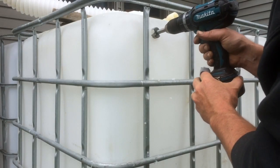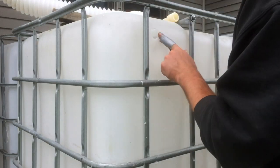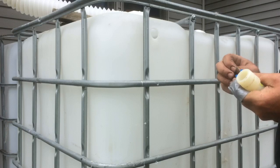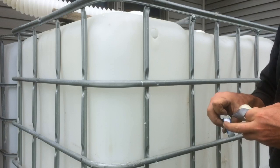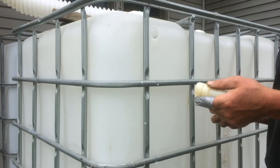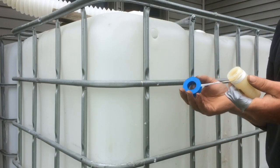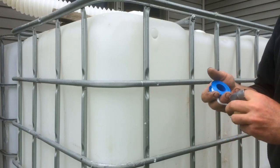I very carefully and slowly drilled into the plastic in a smooth and even way so that I had a very clean hole — just a tiny bit smaller than the threading. It's a great way to deal with any potential drips or leaks, especially for an overflow where a little bit of leaking is not the end of the world. So I go very liberal with the Teflon tape. For this application, not under pressure, it works quite well.